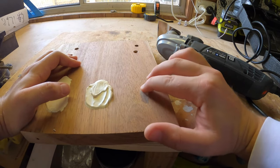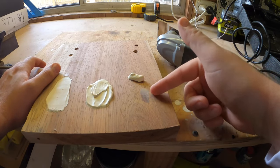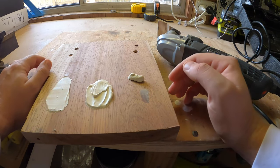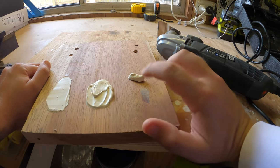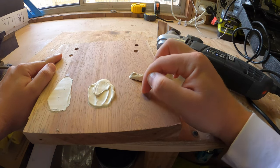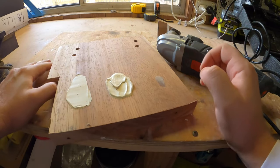The smear left here is so thin I can literally rub my finger flat over it and you don't feel it. If I had my eyes closed I would not know there was something on that surface - there is something there, but it's minimal. You can hit it again with the multi-tool to try and get it off, but I personally think you do risk cutting into the surface of the wood. If this was white Sikaflex on a white boat I would probably leave it - I don't think anyone would notice. If you're pedantic you could use wet and dry sandpaper very carefully just on the Sikaflex.